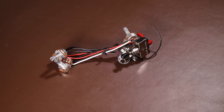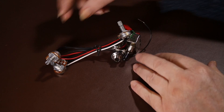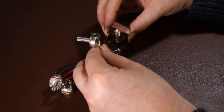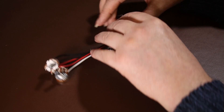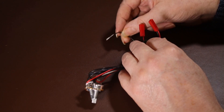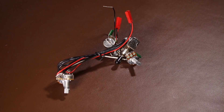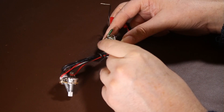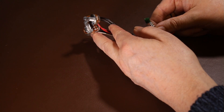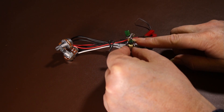The wiring loom looks intact and ready to go — everything is soldered in place quite neatly. You've got everything from the jack plug through the volumes and tone controls to the pickup selector switch. There are two sockets ready to receive the plugs from the pickups so you don't have to solder there, and one tinned wire which is the earth. As a side note, you can tell tone controls from volume controls by the presence of a capacitor — that little green blob soldered onto the side — which is what makes it a tone control.